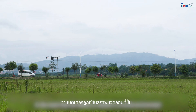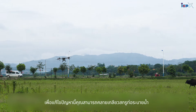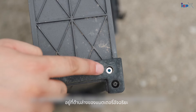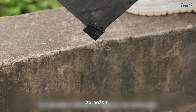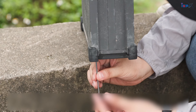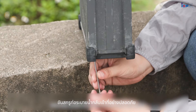In the event that the battery is utilized in a humid environment, there is a possibility of water droplets condensing inside it. To address this issue, you can unscrew the drain screw located at the bottom of the smart battery. Subsequently, relocate the battery to a dry environment, allowing the inside to dry out completely. Once the drying process is complete, securely screw the drain screw back into place.